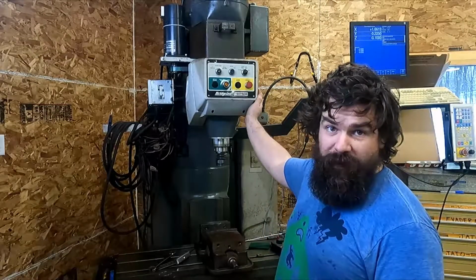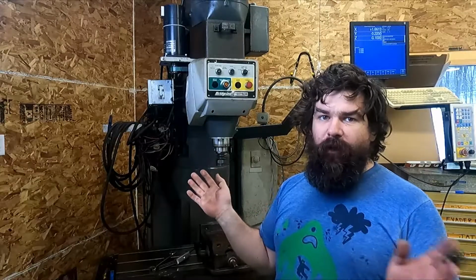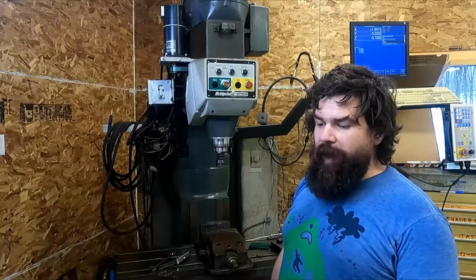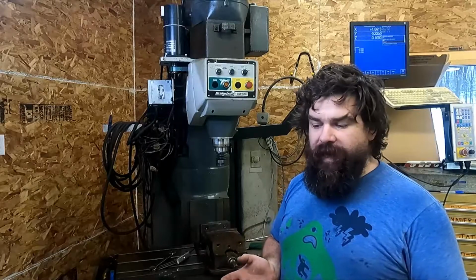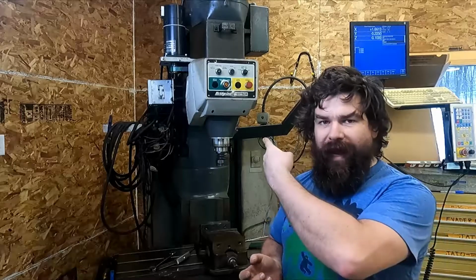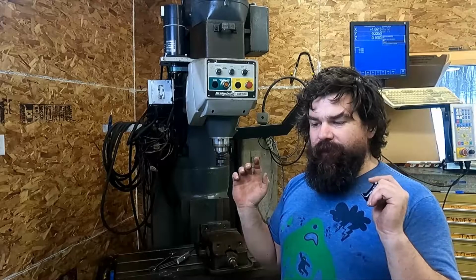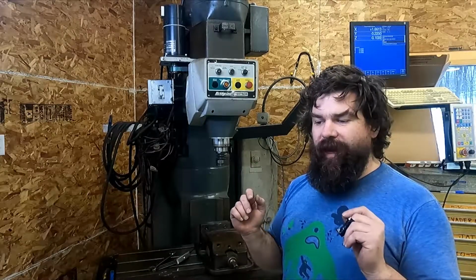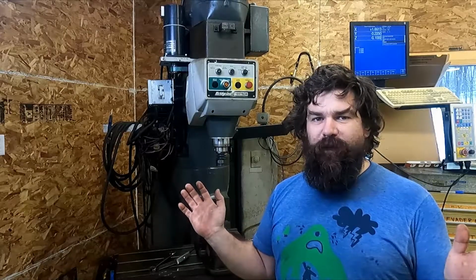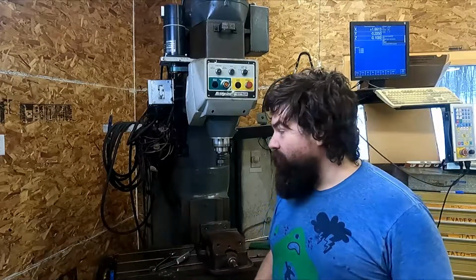All right, so we're back, and everything is connected up. It's working finally. I did a little bit of troubleshooting, and the quick start guide I followed was not very good. I ended up going into the programming manual, but basically there were a few things that were a little confusing, and of course where you set the maximum frequency, there's a decimal place, which meant I had set the maximum frequency to 1/10 of what I wanted to, which is pretty annoying because none of the other frequencies have decimal places. So be warned, I was at an angle and I couldn't see the bottom of the number. So it is what it is.